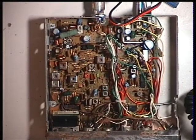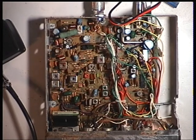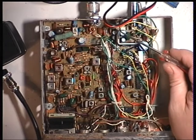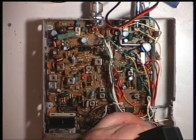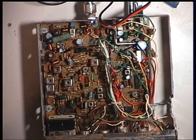Back to this radio. I've put the audio IC in. I found a scrap chassis which had been connected to mains - some people are so stupid they think the power lead plugs into a mains supply, so it had 240 volts up it and that was the end of that set. What I've been able to do is pinch the heatsink off that and put a new audio IC on it. Obviously I wasn't going to use the audio IC that had been on the mains. So what we're going to do first is try to get this radio to work in public address mode, because it's in such a state I wouldn't contemplate a full repair for a customer - this is a scrap chassis we bought in.